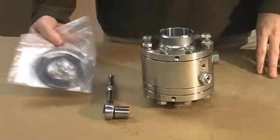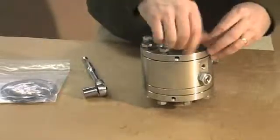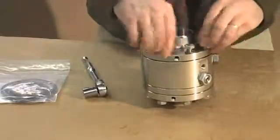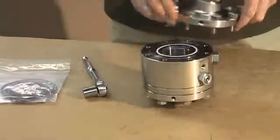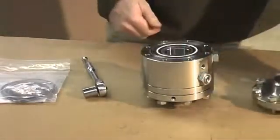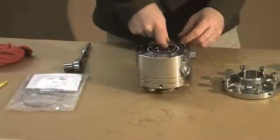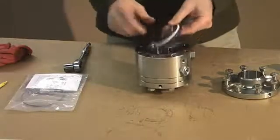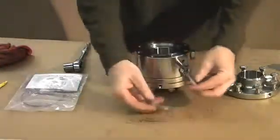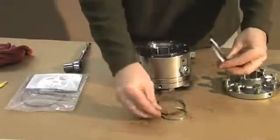To begin maintenance, you loosen the bolts of the sealing cap, and that's going to allow you to remove the sealing flange and give you access to your main seals. With the sealing flange off, you now have access to your main backup and environmental seals. To remove those seals, remove the entire seal pack, which consists of your stainless steel smoothbore ring, your main product seal, a Teflon spacer, and your backup seal. You'll also remove your environmental seal, and you'll want to make sure that the sealing areas are all clean.